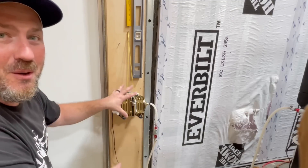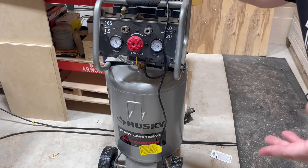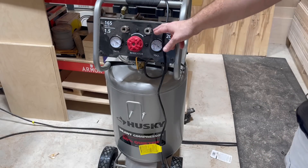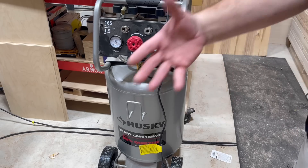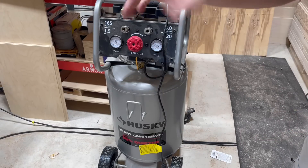That's a tip. If you do go with the system, I do have a much larger air compressor if I need it. When I'm cutting through something like three-eighths inch or half-inch material, that gives me a little more PSI. I recommend about 25 to 30 PSI if you're going to cut thicker material, but for that thin stuff, it's all you need.